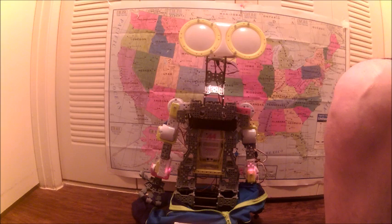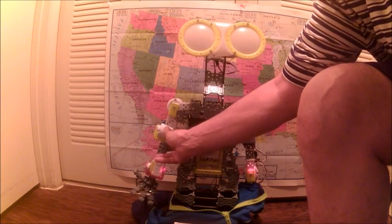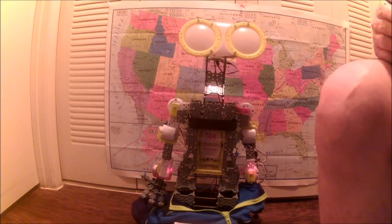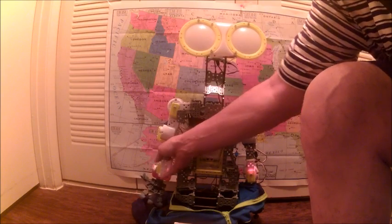With a straight arm, the top servo reaches its stall torque limit at about 50%. With a folding arm, it's about 80 to 90% accurate — for instance, 75% movement is more like 70%, and 50% is more like 40%. The wiring for the hand servo goes to the elbow, and then the elbow goes to the shoulder, and then the shoulder goes into the MechaBrain. It's daisy-chained, like the original installation. You can see the wiring here.